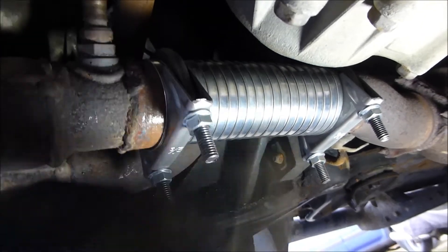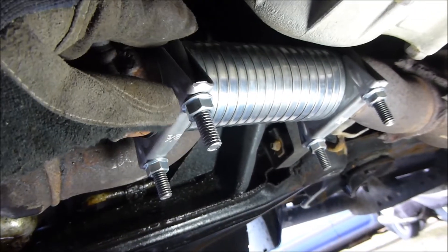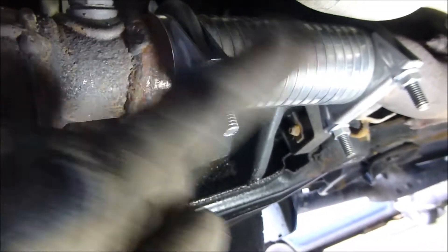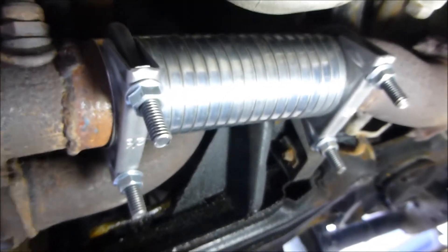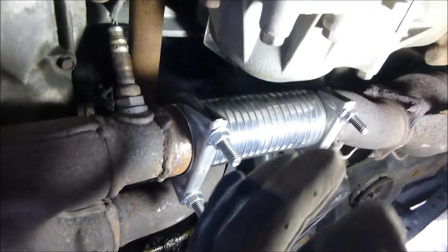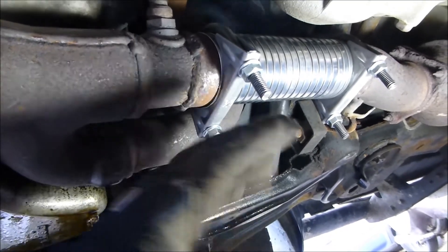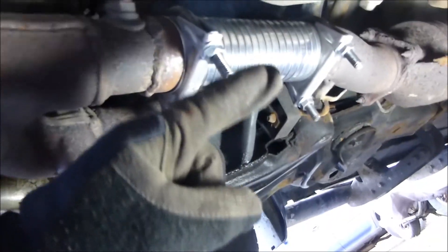This is the final product. Don't put the clamps on too tight because it's going to crush your pipe — just install them and once it's tight, give it only one or two turns. I've got it right here and I'm ready to test it. She's running now, but there's manufactured oil on it so I'll let it run just a bit to warm up, then I'll make one more turn on each clamp to make sure it's really tight. If you like this video, give it a thumbs up or subscribe.